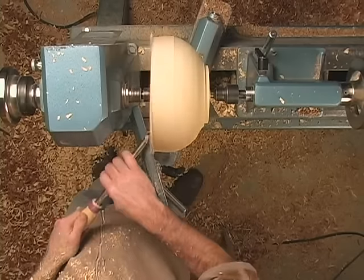Let's talk about the epoxies and urethanes. I don't know of any other finish that's more durable than these two products here for our wood turnings. However, they're not that repairable. For instance, if I made a salad bowl and I had used one of these finishes and I've worn away a little bit of that finish over time and I try to reapply these finishes over that surface, they don't blend in too well without substantial labor on my part. Now, what I'm saying is membrane finishes may be more suitable for artistic items than they are for utility.